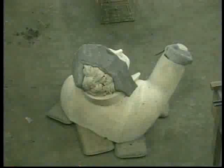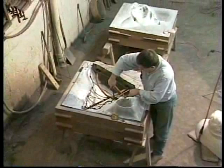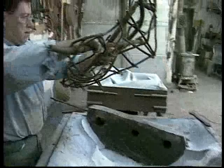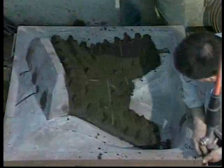Now, the core of the mold must be made. The core must fit in the cavity of the outer mold with just a quarter-inch clearance all around for the bronze. To make the core for the bust of the poet, a metal armature is shaped inside the hollow mold. Parts of the armature extend into the outer mold to hold the core firmly in place. The armature is removed, and a thin layer of sand is then added to the cavity and rammed. The armature is then reinserted. Sand is built up to duplicate as nearly as possible the mold in the drag. Small clumps of sand are added to the surface to help determine the shape of the core. By fitting the cope on the drag and then lifting it off, the molder can see where the two surfaces touched and add or remove sand where needed.